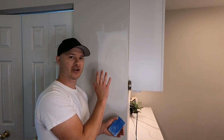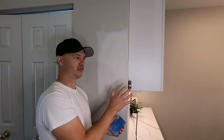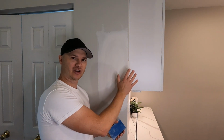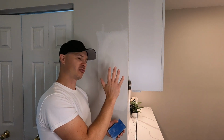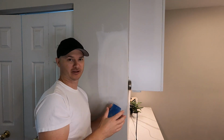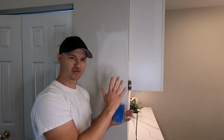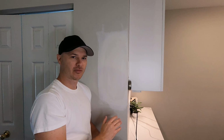But the key is you want to have this good and dry, because you don't want any issues with sanding. You also don't want to sand the top layer, paint this, and then it dries, and then over time it shrinks up a little bit, and then you might see some of the shrinkage. So once it's good and all the water's out and it's shrunk and everything's solid, you just need to sand it.